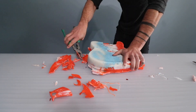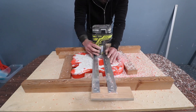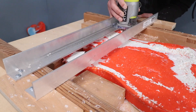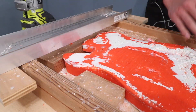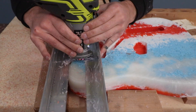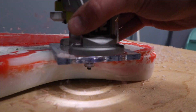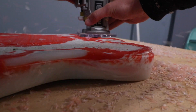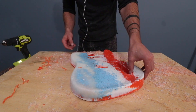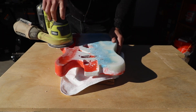After using tin snips to clean up the edges, I made a router sled to flatten the back side. The plastic itself is really easy to machine — it's about the same hardness as wood. There was a little bit of warping around the spot where the neck connects to the base, so I had to carefully re-carve out that recess. I used a round-over bit to smooth over the edges, a really long drill bit to connect the recesses that'll allow us to wire the guitar, and then sanded the plastic up to 400 grit.